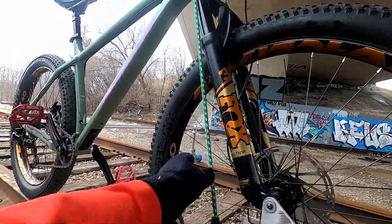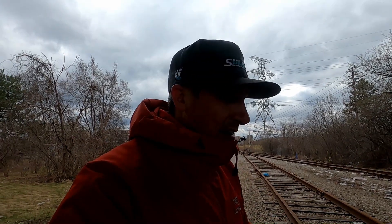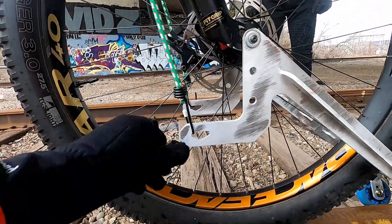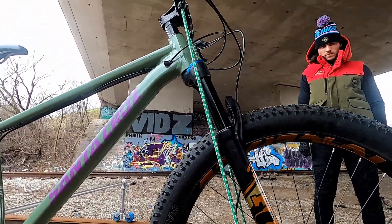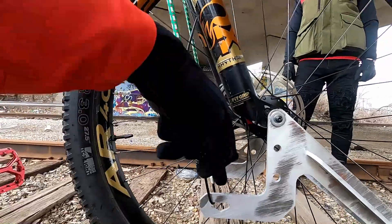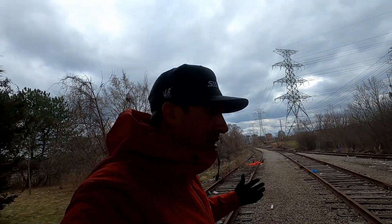The biggest upgrade: it doesn't look like it because we've got these janky bungee cords, but we found that confidence when riding fast depends on how unlikely it is for the device to leave the rail. The old one just used gravity. So we've cut past the centerline back here. I had planned on using Titan straps but they were too short, so I found these old bungee cords in the back of my car. We've attached it to the handlebars, and that applies a force up which holds this down — meaning this shouldn't be able to leave the track.